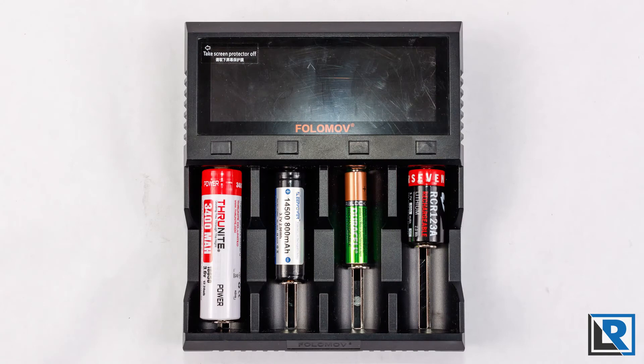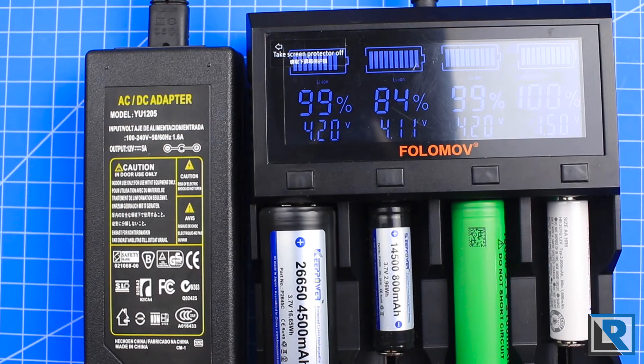My conclusion is this is a fairly simple charger, but it's fast for both lithium-ion and nickel metal hydride batteries. I'd rate it as a good charger, but not the best. It seems to have a little bit of trouble terminating the nickel metal hydride — it's more of a constant charge instead of an active charger — so I probably won't use it for NiMH as much as I will for my lithium batteries. Where this thing really shines is in the fast charging of lithium batteries. The UI is a little bit slow when changing rates, and it hits a wall at 98–99% with that last 2% taking longer than it should. It has a large external power supply with a lot of cord length, so this probably isn't going to be my mobile charger, but if it's sitting at home it won't be a problem.